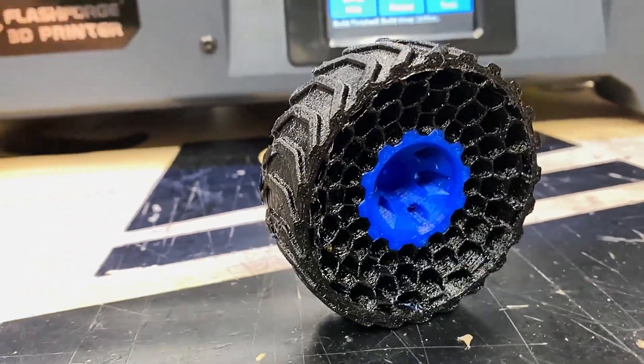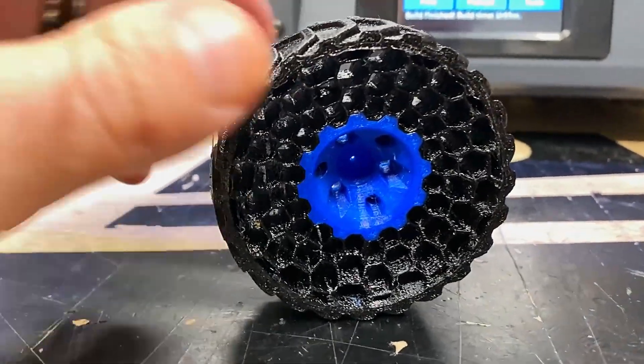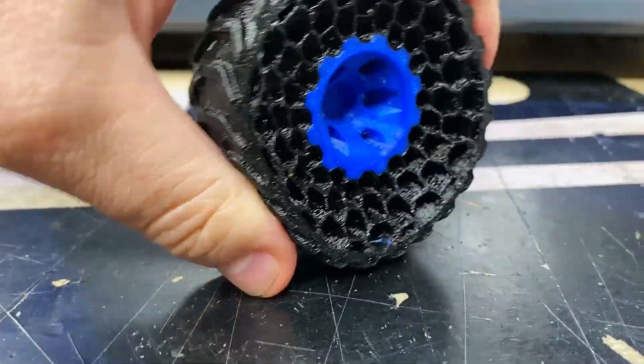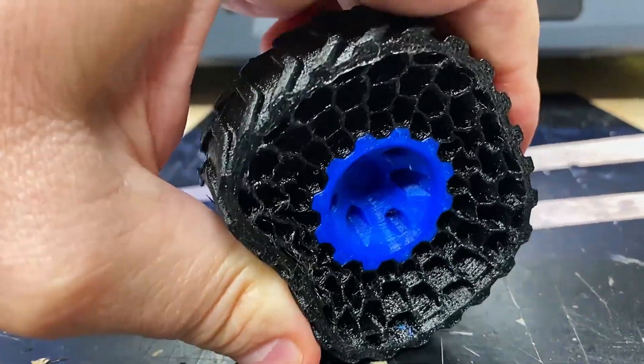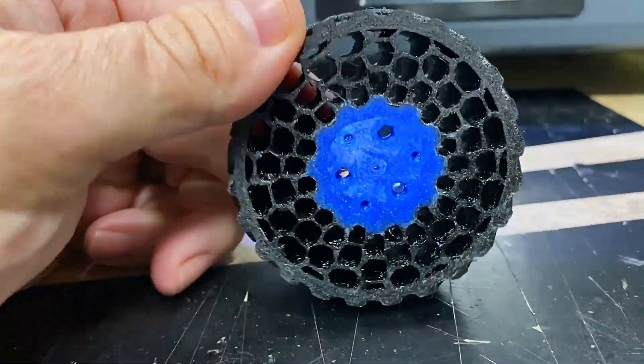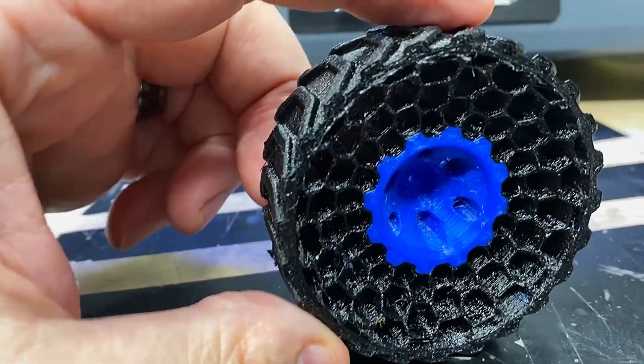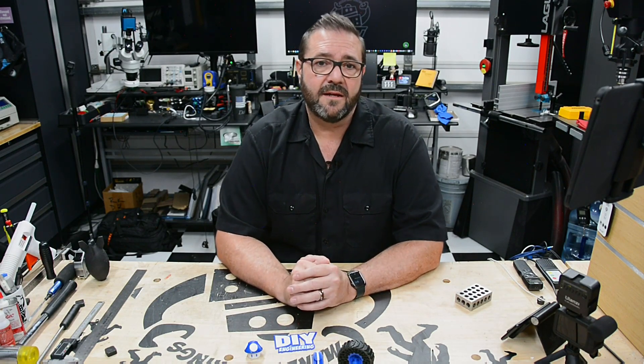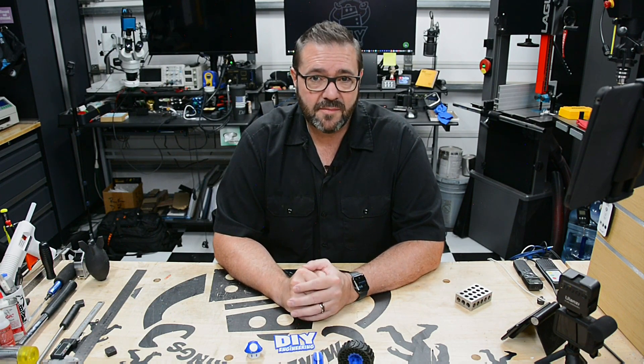I did a couple of other prints to try alternate use cases. For example, this tire and wheel is PLA and TPU, giving it a hard wheel with a soft tire — a great example of a purpose-built object using dual extrusion to create a single object without any modifications. While the printer does a pretty good job, I rarely use FDM for surface quality; when I want something that looks great I'd recommend using a resin printer, as the results will always be superior to FDM.